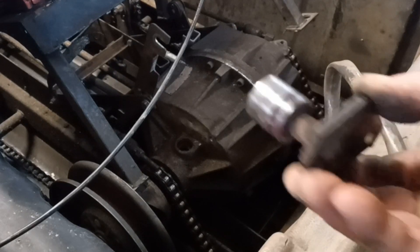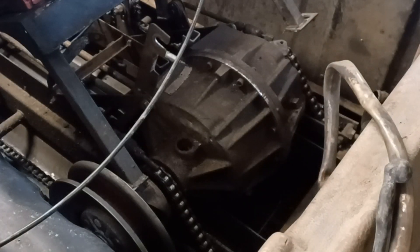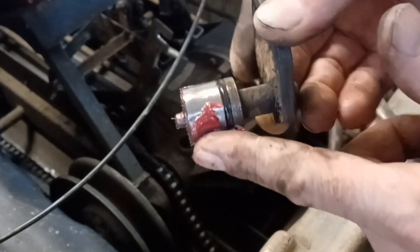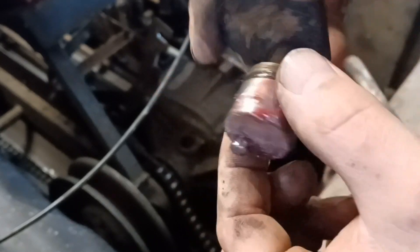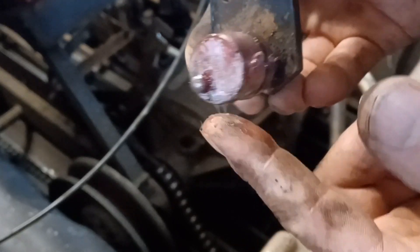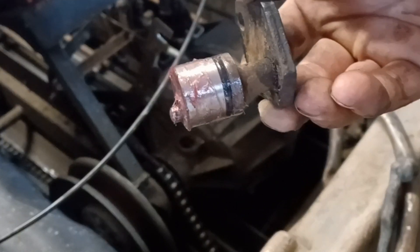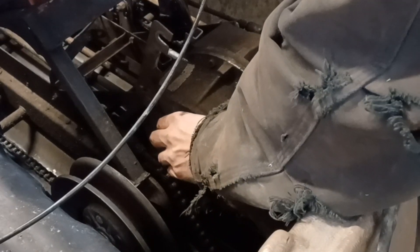So I got the piece cleaned up. I'm going to take a little bit of high temperature grease - I cleaned this up really, really well and got all the crud off of it. There's an O-ring right there; you want to make sure that's in good shape. I'm going to put a healthy amount of grease on this, especially up around this top ring. That O-ring seals it so it doesn't get crud down into it, but this thing has to twist down inside that hole. So we want to get that good and greased up, and then drop this back in - that should go in nice and free.